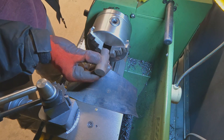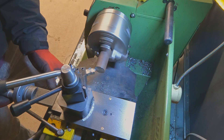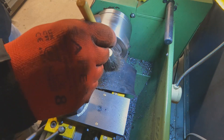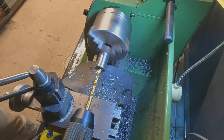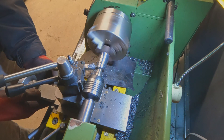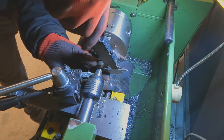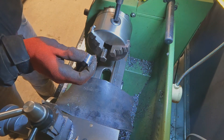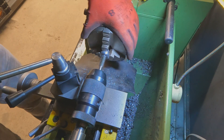I'm going to move on to the lathe and mount the stock in a three-jaw chuck and just clean up that face — it's got bandsaw marks where we cut it off, so clean that up nice and tidy. Because it's looking a bit rusty and nasty I'm also going to clean the surface up as well so we've got something nice to work with. From there I've drilled out the centre section — this will be for when I go to tap the part. I'm giving it some tail support and then taking the shoulder down to 18mm, which matches the drill holes I've placed within the legs, so that boss will fit in there nicely. I then took the part over to the bandsaw to cut off the rest of the material, and proceeded to tap out the centre section — this is an M10 tap.